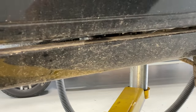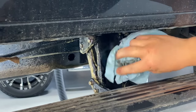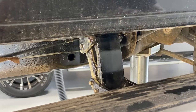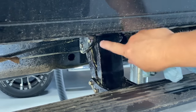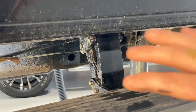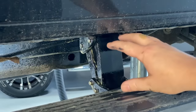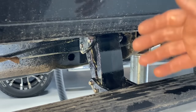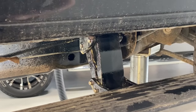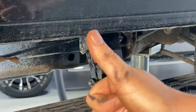After a while, wipe off the excess. Anything left on there is actually going to stay, harden up a little thicker, pick up a little dust, and stick to the surface. Leave it on the hinge pin locations and that's it. The system is lubricated, it's working, and it's protecting from future corrosion. Ideally this is the last time you need to touch it, but realistically the Fluid Film will get washed off down in the muck. So every fall before salt season, come back and do the Fluid Film — that's all you'll need to keep it going. Hope this helped you guys fix your Ford yourself — see you next time.